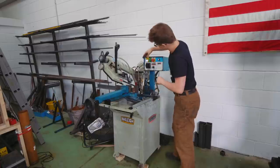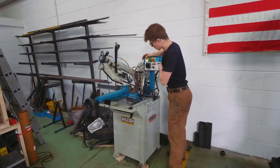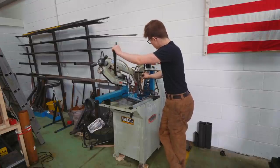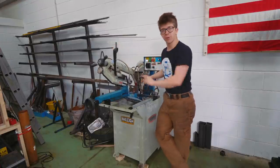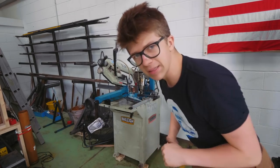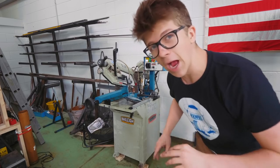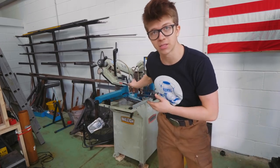When I'm cutting my Damascus, I'll make sure I'm cutting it nice and slow on the blade speed. I'll also make sure that the feed rate on the saw is nice and slow. And this is the point where I worry and pray that nine months ago when I made this billet in Damascus, I hope I annealed it. If I didn't, then I'm about to break a blade.